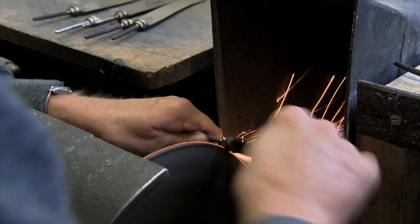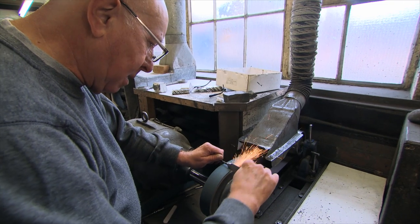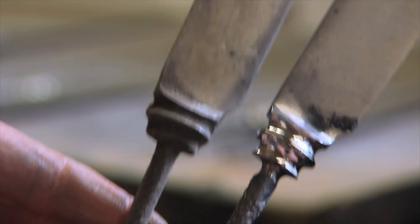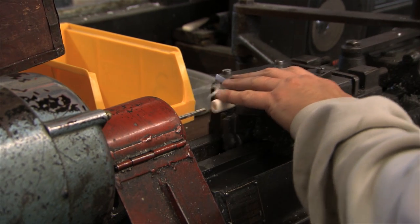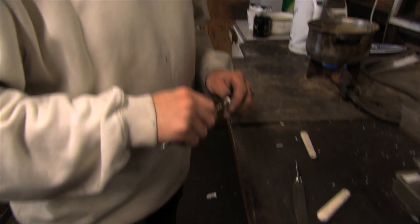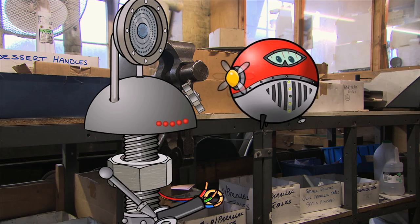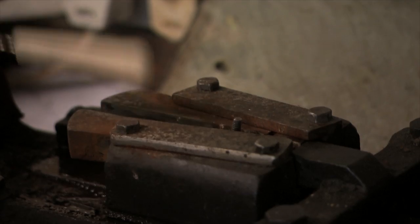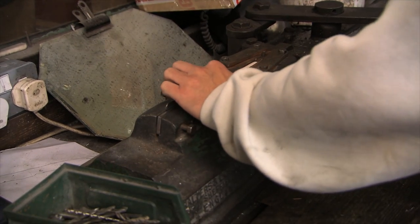Whoa, what's going on here? Knives are a little different. You need to grind them so they're thick and strong at the top, and thin and sharp at the bottom — makes them better for cutting. Then it gets smooth and polished. Knives here are also different because they get a fancy handle. He's drilling a hole in it now. Now all we have to do is insert a blade. The hot water makes the handle expand just a little, so it opens up — so we can just tap in the metal part really gently. And when it cools, it shrinks and locks it in tight.